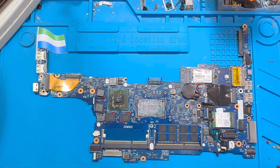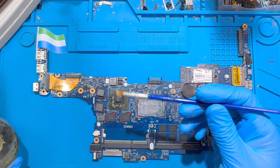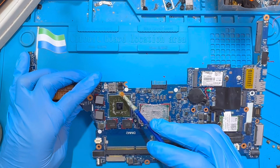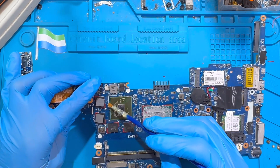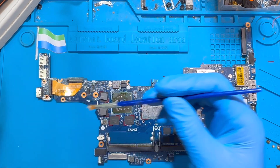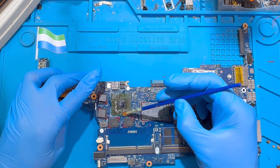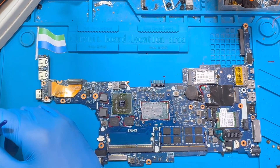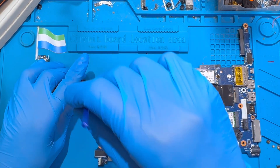After you remove all the glue around the processor, use the oil — the sweet green oil (flux). Put a small bit on all four corners of the chip, here and here on all sides.